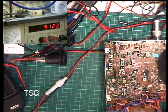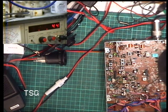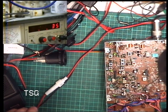So ideally we change the crystal and make that 10.24, but in reality we're going to compensate the transmit. We can get that right, that's not a problem. The receive won't be off frequency, but its IF could be lopsided. So instead of 10.695, it could end up as 10.693 or something like that. But in reality, it's not going to make much difference. But that's the first thing we needed to set.